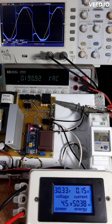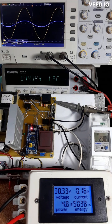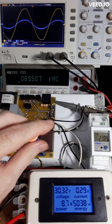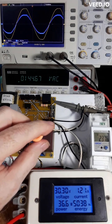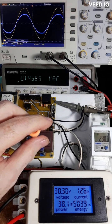I'm going to bring it up a little higher. If we were going to grid tie right now, you'd want to make sure that the output of the inverter is higher than the grid, so that when it closes you're definitely not feeding back. Because we're in the load right now, I'm going to close the switch — now it's loaded down. You can see that it's 44 volts. So now we can bring this up. You can see it's a pretty decent sine wave. The voltage is coming up on the meter — 145 volts AC. We're about 38 watts DC coming in, 1.2 amps.